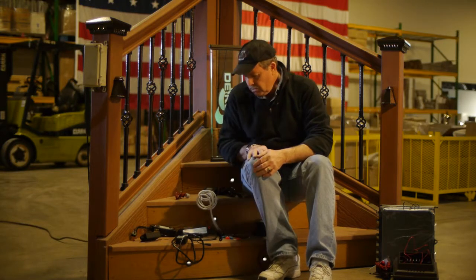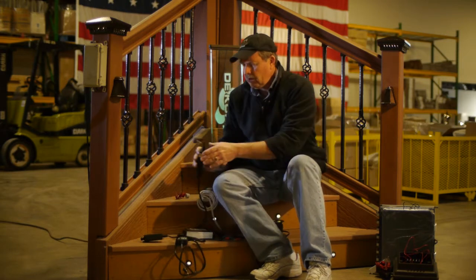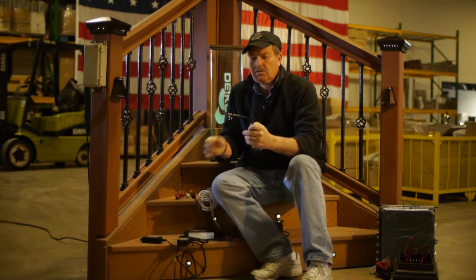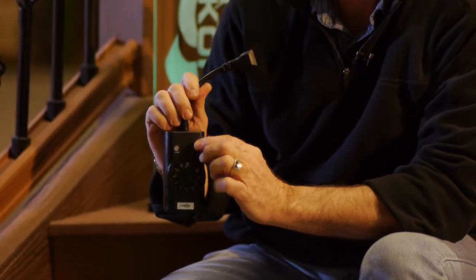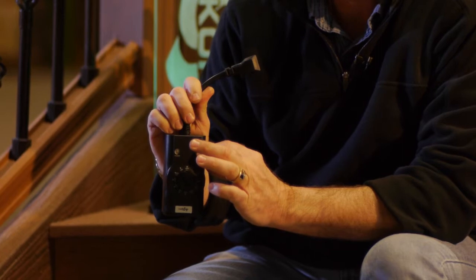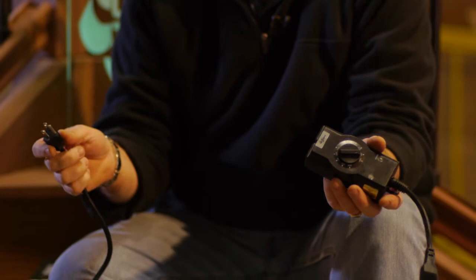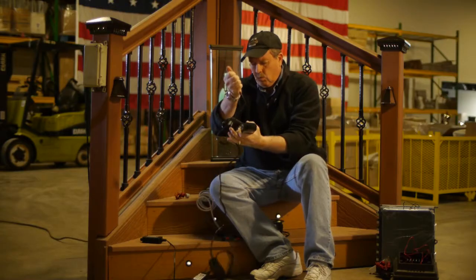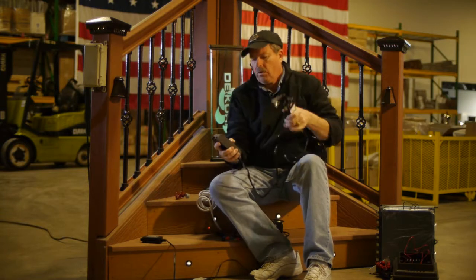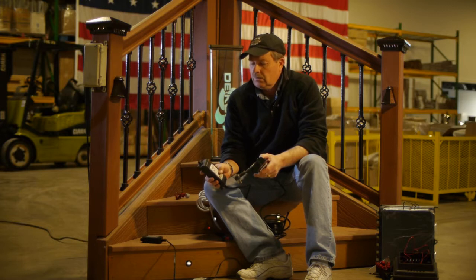You're going to take an AC circuit, which is just a regular outlet on the outside of your house, and plug our timer into it. You'll know you've got power to it because it has an indicator light on it. The transformer — the core transformer, which is waterproof — is going to plug into that. When the power goes into the transformer, it's going to convert it from AC to DC, and then we've got a very clean circuit out to the LEDs.